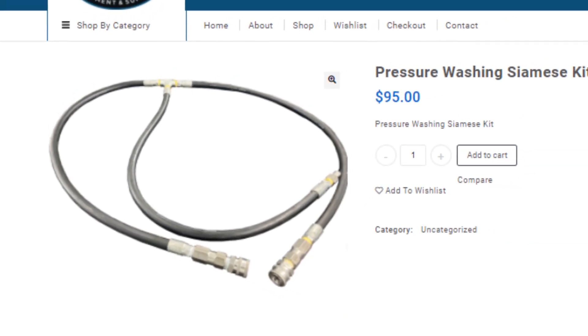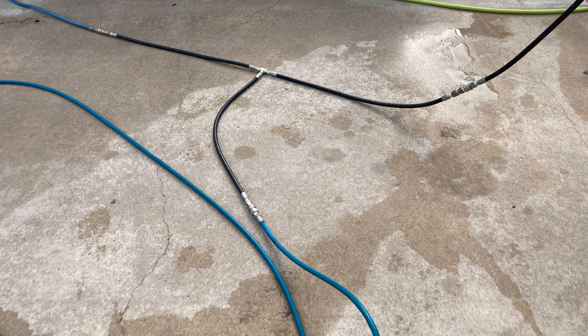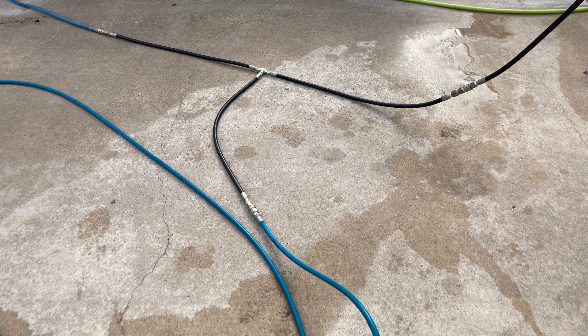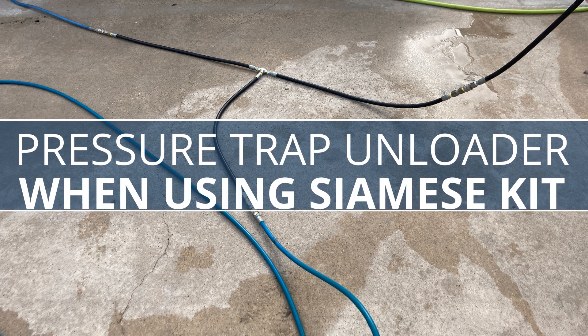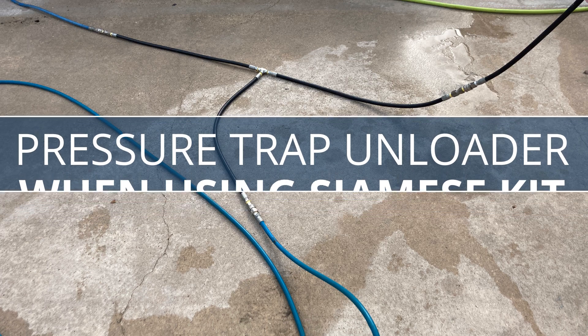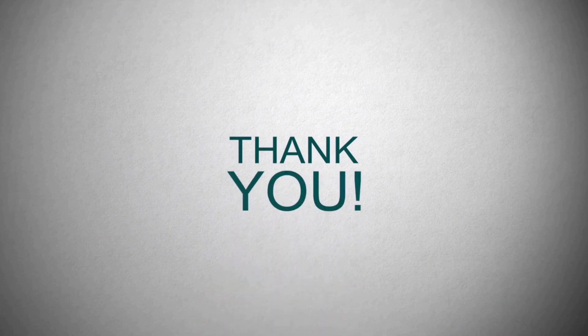If you have any questions just let me know. We'll have these available at the store. If you've only got one machine then this is not something that's going to help you — you don't need it yet. But if you do have two machines, same type of pump, same type of unloader — and I don't recommend using these if you have flow-actuated unloaders, those are the type where when you pull the trigger it gives a small burst and then increases pressure within a couple seconds. I don't use those, don't like them. Make sure you have what's called pressure trap unloaders if you're going to use this. Thanks for watching; if you have any questions or comments, just leave them below.